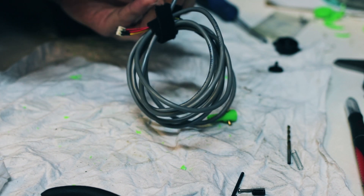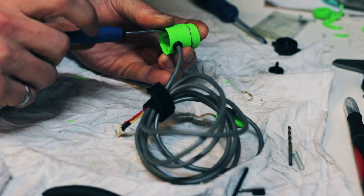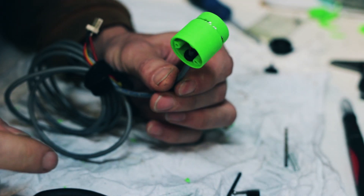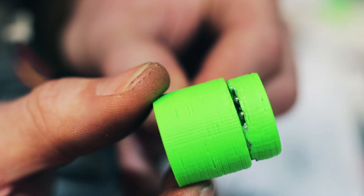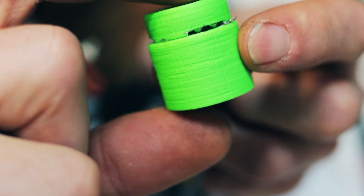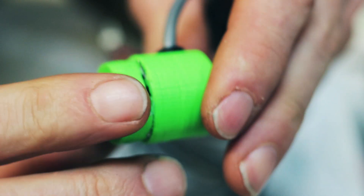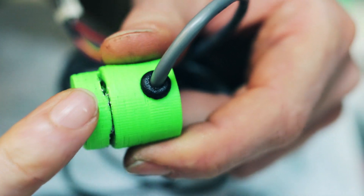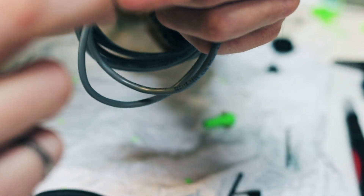Now that they're started the balls won't fall out. You can see where the wires are sticking out — this is where the split was, so the connection goes all the way around from this wire, through all six contacts, to this one. The wires need to be pressed between these two pieces so they get good contact to that aluminum foil. It sounds tricky but is ridiculously easy the way we did it. With it sandwiched together, torque up the screws. Not too tight — it is 3D printed after all. That's the body rebuilt.